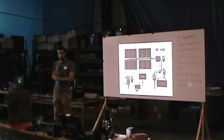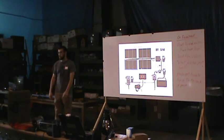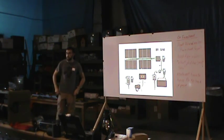I use gel batteries. The Optima gel batteries are very expensive, and I also use industrial grade truck batteries for over-the-road trucks. Those are the two I use. I would never, ever discharge my batteries more than 60%. If you do, you're on a slow downhill decline to death in those states. It is what it is.